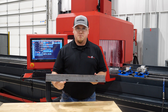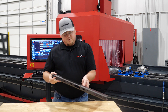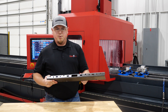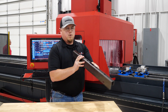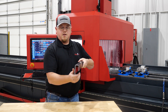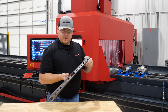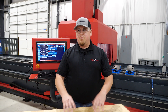So we ramped in these slots with the three-eighths end mill, and then the second op was all of the features on the bottom side of the J — some holes, some slots, and a little bit bigger pocket right there in the middle. The orientation was in the vise sitting on the flat side, using another piece of material to clamp on the back side in the vise, and running the drill and the end mill to put all those features in.